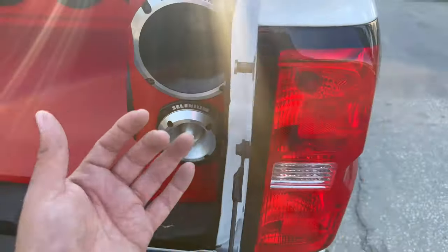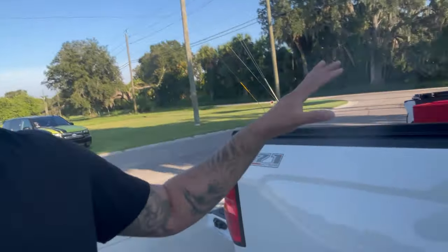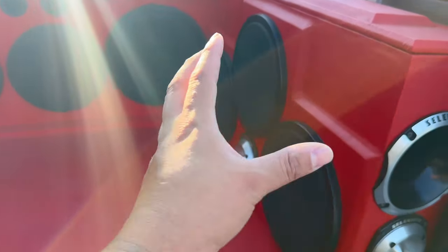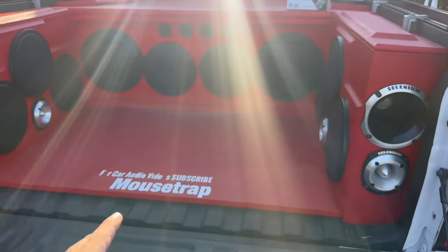Those horns on their own EQ and DSP would do some mad talking. For tweeters I'd put at least a 500-watt amp to guarantee not blowing them. I have a DS 250 for the tweeters, but if I bridge them parallel in a two-ohm load it'll blow them — it happened at the classics last year, only the tweeters blew. I dropped the impedance to four-ohm mono and they play fine now. So 500 watts on the tweeters, a massive 3000 watts on the twelve horns. Right now it's about 6000 watts back here with 3K and 3K, but I'd like to go 5K and 5K for 10,000 watts — turning this into a 12,000-watt stunt wall system.